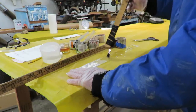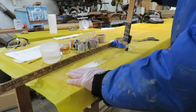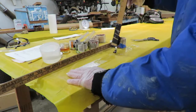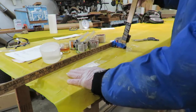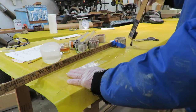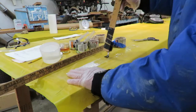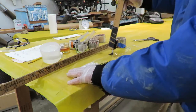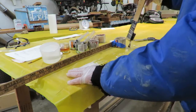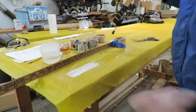Okay, I think you can see how this goes. And we will keep brushing until all the cloth has turned clear. We have no white parts left in the cloth. But we want to keep this as thin as possible, and so we'll keep brushing over it and make sure that we don't have any excess epoxy, but we do want to saturate it. And then we'll be back inside the boat, and so we'll see you soon inside the boat.